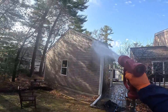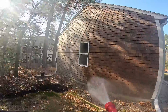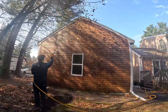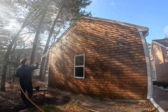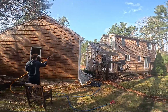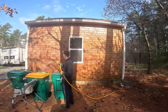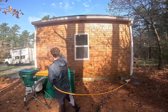We're all set with the whole main house and that little section of roof, the roof on the garage. I'm just pre-wetting the rear of the garage and I'll be pre-wetting the right side of the garage. Calum will come back, spray it all up, and we'll be all done. Calum actually took off the six-foot wand — I personally wouldn't have, but it's not that tall, so it's a nice easy shot. The fan spray still reaches very far. We've done tests with the shooter tip and get about 43 feet. This is a 110 booster pump with a stainless steel head — you can get it at softwashfactory.com.